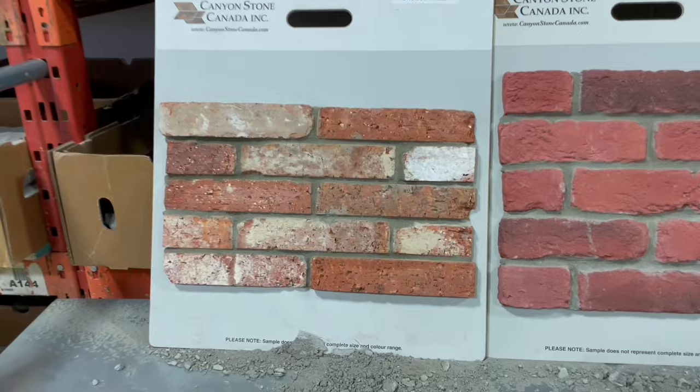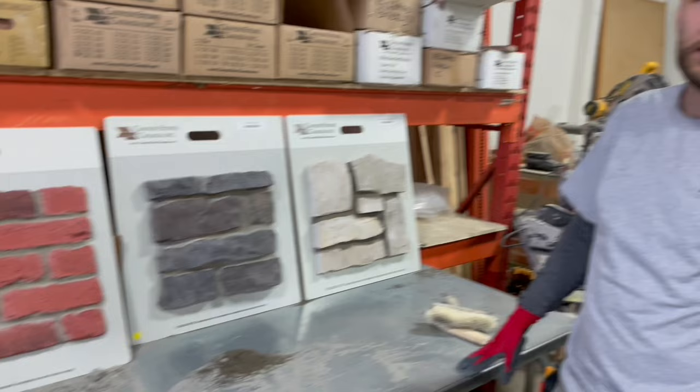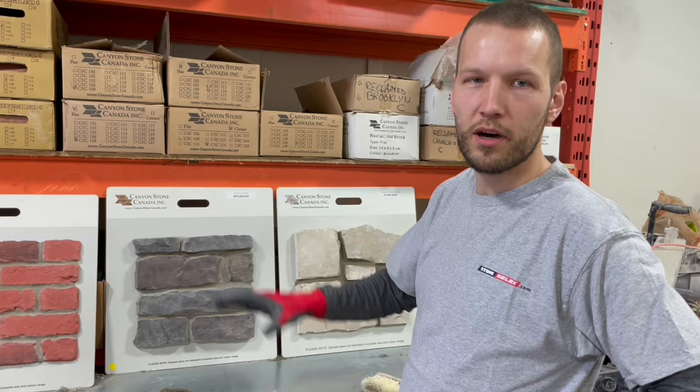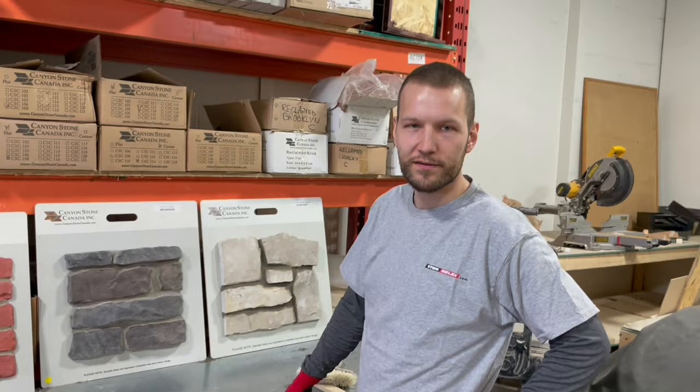We're all done with our grouting - we've laid the grout, let it dry, tooled it, brushed it, and it looks beautiful. Make sure you have a tarp or something for your floor to protect and clean up. One more important tip: you don't want to do any cleaning with water on the grout for at least two days. Even though it appears dry, it still has moisture in it - adding water, like when mopping, could pull some of the color from the grout and create a glaze. Also the color will slightly brighten as it dries completely in about two to three days, so what you see now will be just a shade or two lighter. Thanks for watching - you've just learned how to apply grout.